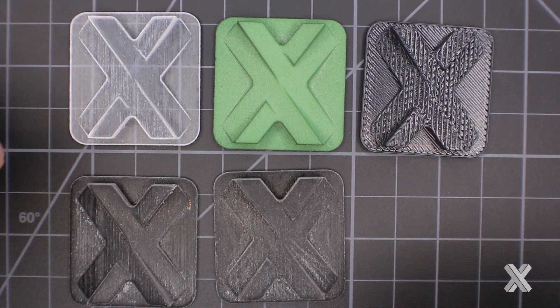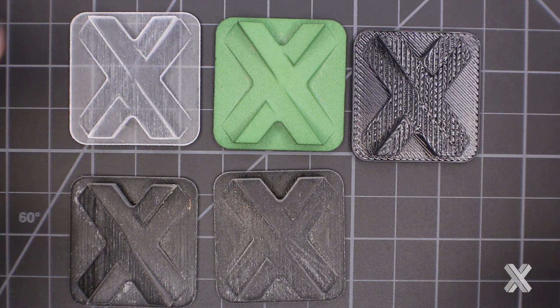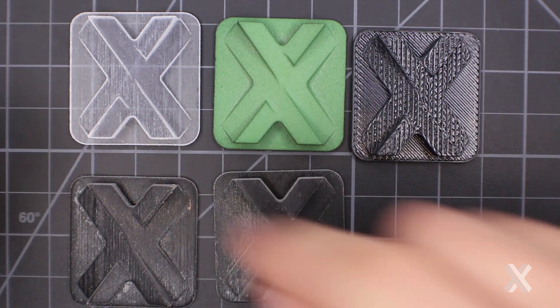Where parts like FDM are boutique builds based off that single material alone — like ABS, Ultem, polycarbonate — you're building a build just to make that one material. With PolyJet you can do multiple different finishes, including a multi-material part in a single build.